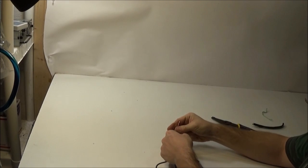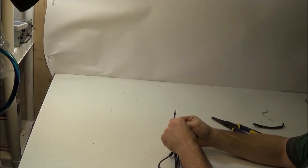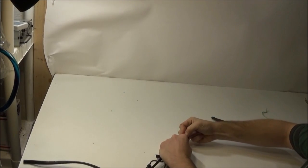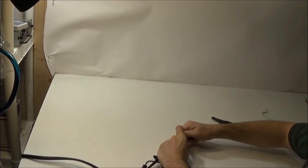To add to this — people will think, oh, if the wire gets pulled on it's going to come out of the wire nut. But your wires should be secured before they get to the wire nut — either by your box, or to the wall, to the stud. A Romex staple, the things you hammer in.